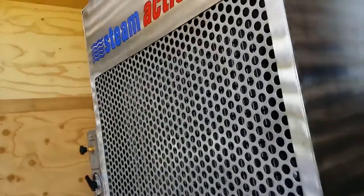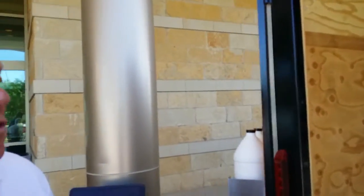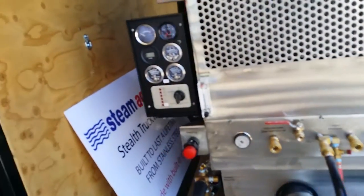So you've got 60 horsepower — turbocharged diesel. And it's spinning with a Roots Blower 68 at 850 CFM, and it's all heat exchanger, right? All heat exchanger. And what is it, a general pump? It's a general pump — it goes up to 3,600 PSI.